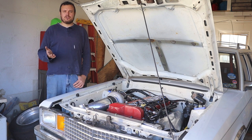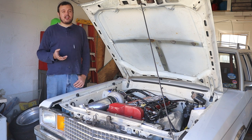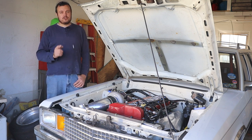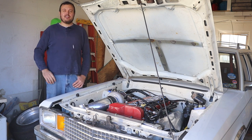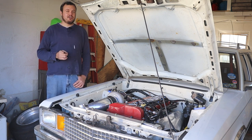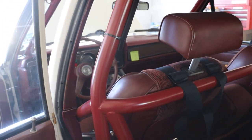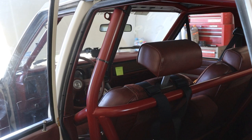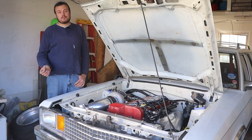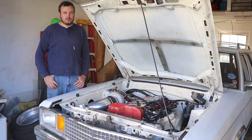What a lot of people will say to you is, oh, chromoly is lighter. Well, that's actually not true. Chromoly and steel have the exact same density. However, with chromoly, they allow you to run a thinner wall tubing and therefore the cage will end up being lighter. The catch is with this material, you have to TIG weld all of the joints in the cage because chromoly can be susceptible to cracking when you overheat it while welding. TIG welding allows more precise control of the heat of the weld, and therefore you have to TIG weld it.